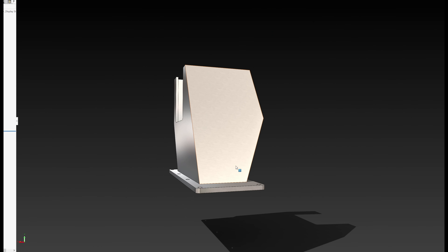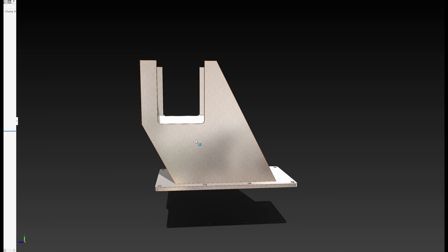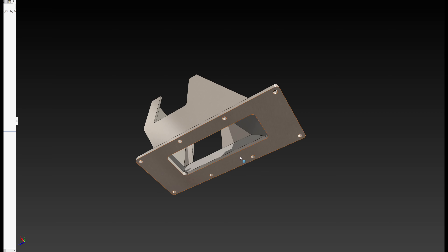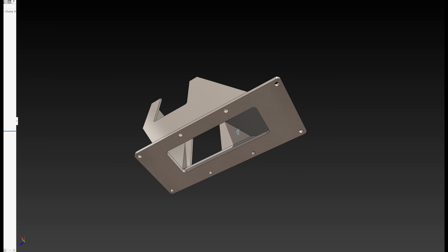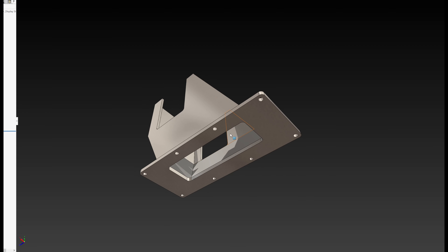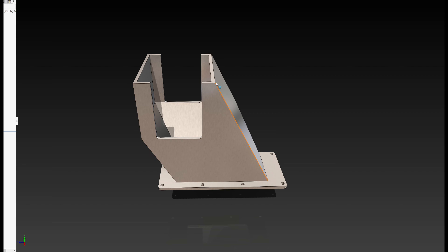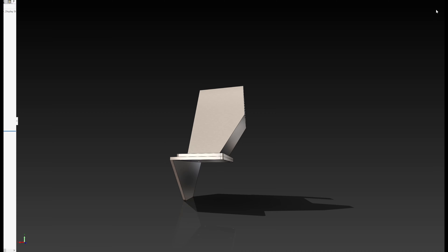The intention long-term is to fill the whole gantry riser with epoxy sand — or epoxy granite, whatever people are calling it — though it seems the best mix is epoxy sand. This will allow me to fill it in through the bottom. I'll also have a gap on the top for accessing the carriage bolts. Epoxy granite will come out of the tops here as well.